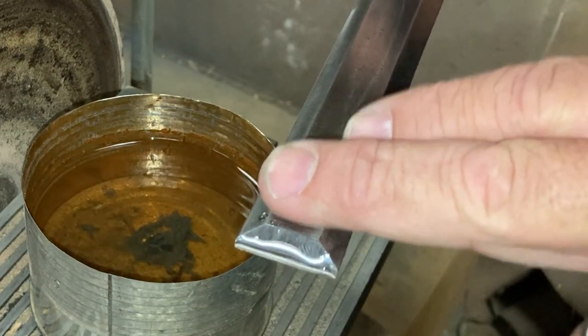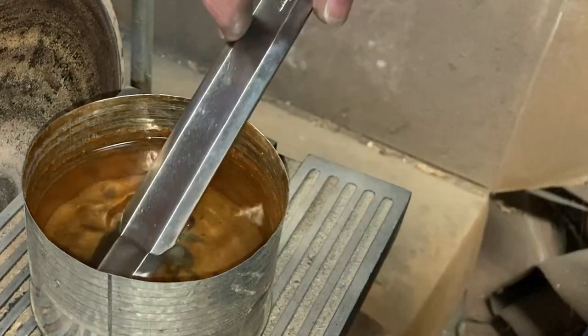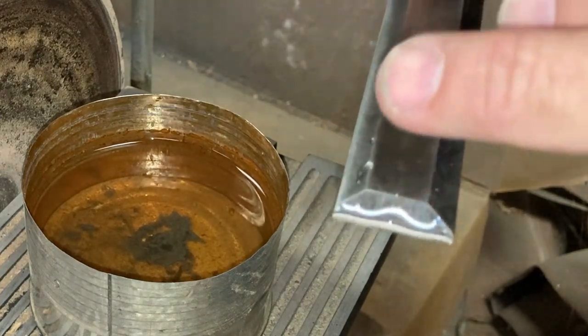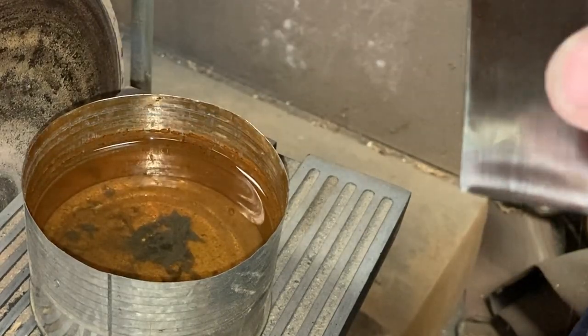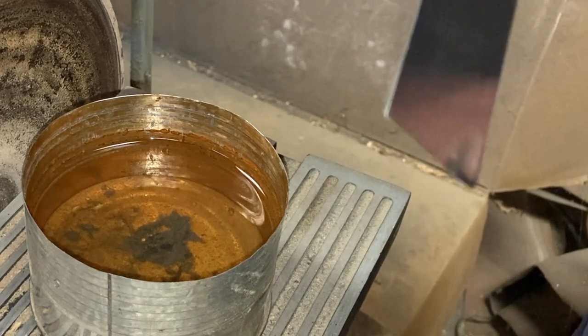Plus, if it starts to burn you, then get it off of there and you dip it again, get that little bubble of surface tension there, and you can go back to sanding again. Should work on both sides. You can see how you keep the water here on the edge. You tip it too much, it'll drip off.